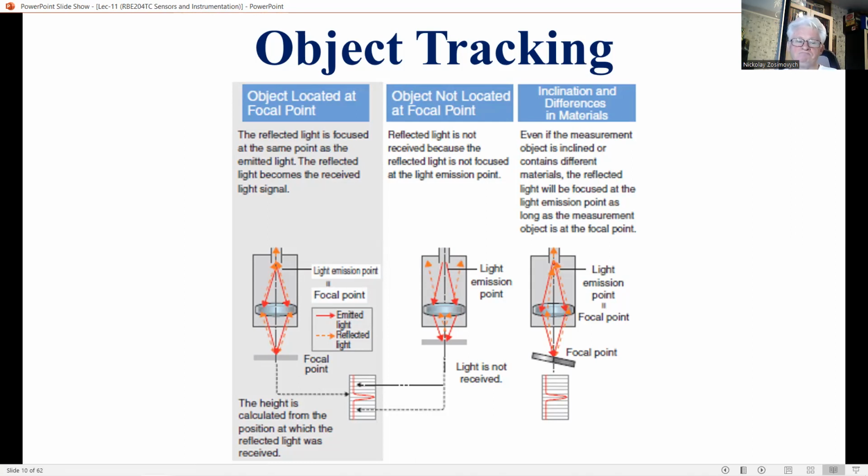The latter approach is characterized by the presence of a light source with known position in the system coordinate frame, and that this position is used to reconstruct the position of the object. Vision systems having environmental lighting do not have that information and require some kind of calibration to reconstruct the object position from one or two-dimensional projections of the scene on the camera chip.